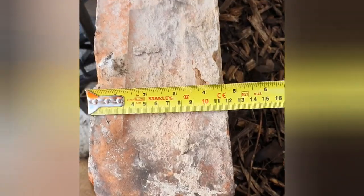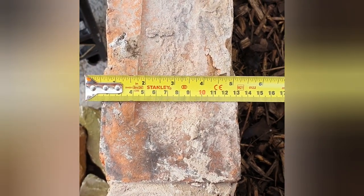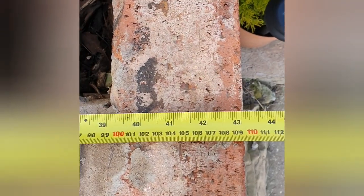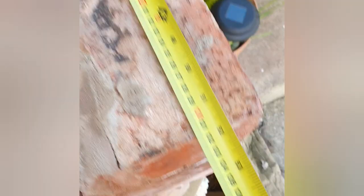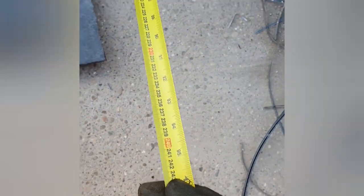All I'm doing here is finding the thickest brick — I'll measure that, so that's 12cm. I'll add just a centimetre each side, so I'll put it at 14cm. That'll look alright. I'll clean all this mess off. Measuring up this brickwork: 110 centimetres this way and about 130 that way, so 2.4 metres which I've got to get out of that.